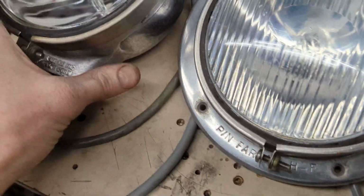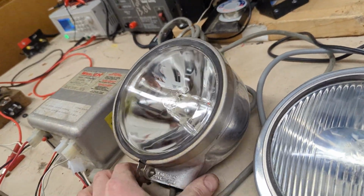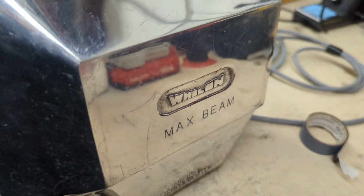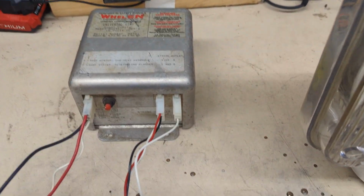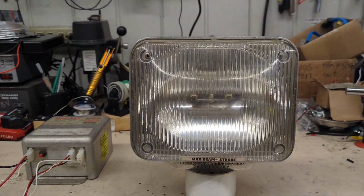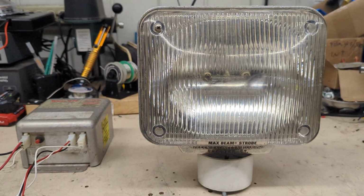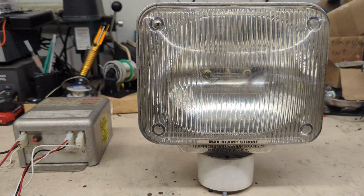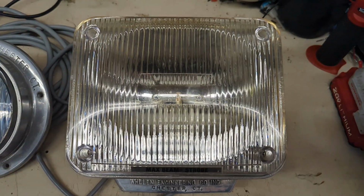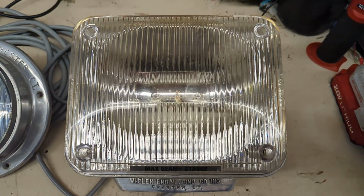The bulb that you use would be your choice, like the literature says. So what we run through here in the video is essentially just a couple of different common traffic clearing light bulbs. The max head, or the max strobe head, and two different PAR 46 beams, one in the cast housing with the clear optics or lack of optics, and then one in the ring housing with the fluted optics. So you can take a look at those and see how effective you think they are, even though the camera maybe doesn't necessarily do them justice. The remaining 5 minutes of this video is comprised of showing the double flash, 120 flashes per minute, two outlets to one head concept with the max beam and the PAR 46 sealed beams at different speeds, angles, lighting conditions.